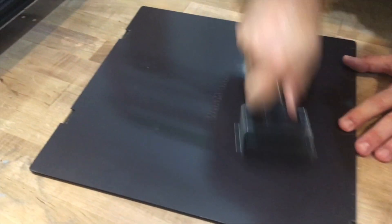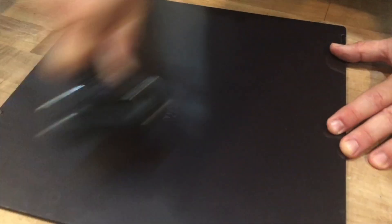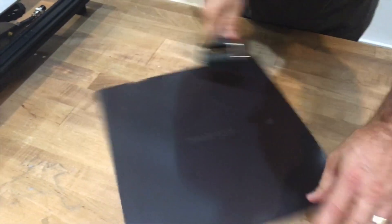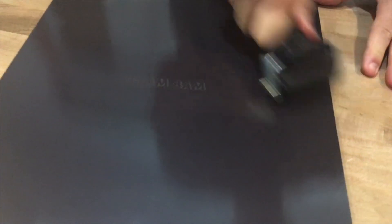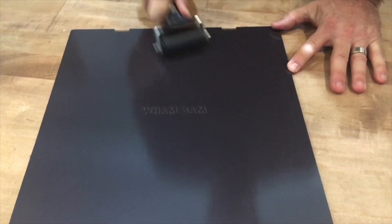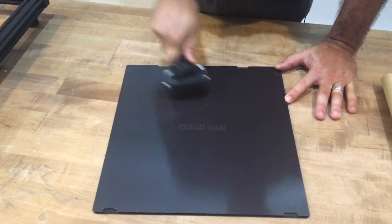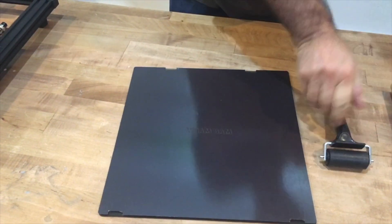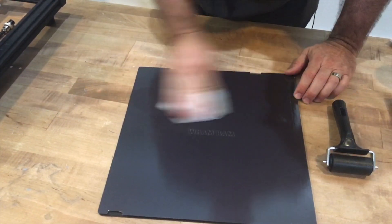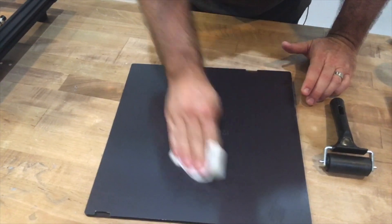And we have a perfectly installed magnetic base. If you ever clean the top surface of the magnet, make sure you don't have pools of alcohol on there because the magnet has been covered with a lacquer to preserve it for longevity. We don't want any solvents or a lot of alcohol on the top surface. If I want to clean it, I'd go very lightly with some alcohol on a paper towel and quickly clean it, letting it dry off before putting on the flexi plate.